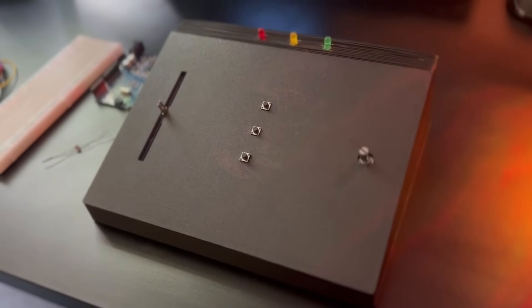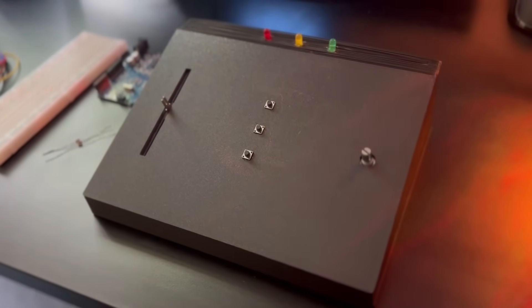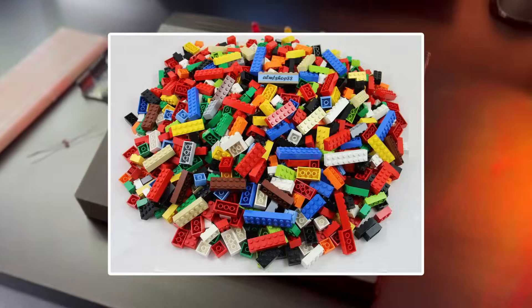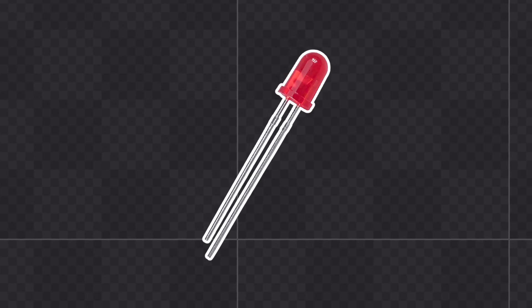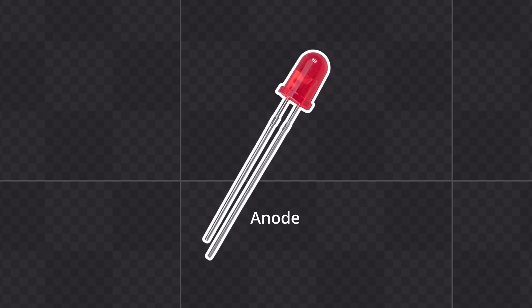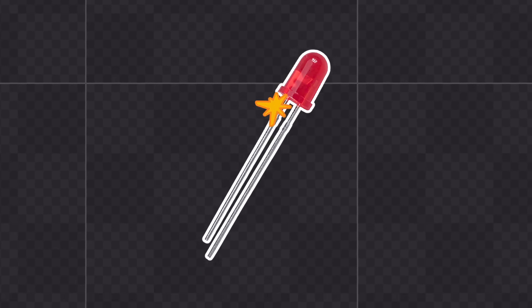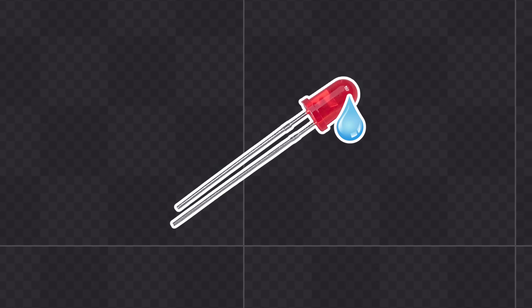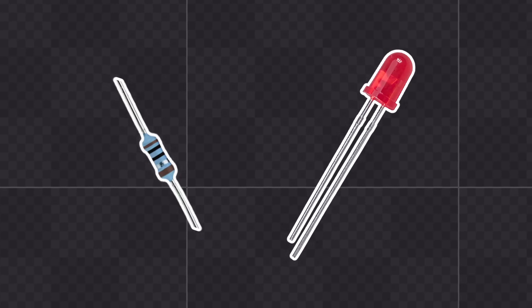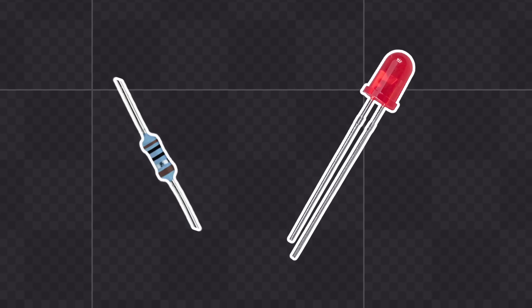Okay, back to the task at hand: wiring. There are a few things to watch out for when wiring certain parts. I'll use an LED as an example. LEDs have two metal prongs called leads — the longer one is the anode and the shorter is the cathode. For the LED to light up, power needs to flow from the anode to the cathode; if you connect it the wrong way around you basically just have a glorified piece of coloured plastic. You also need to use a resistor to ensure your LEDs don't burn out from too much current — the resistor limits the current flowing through the LED, protecting it from damage.